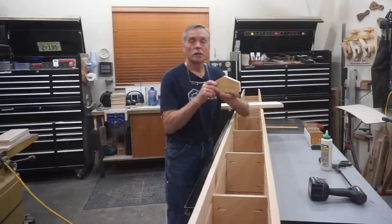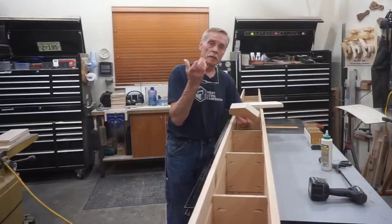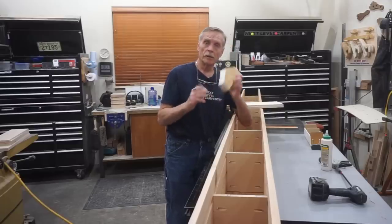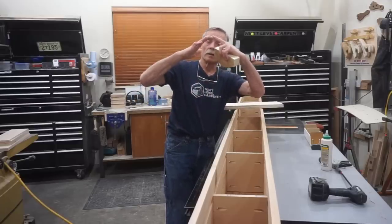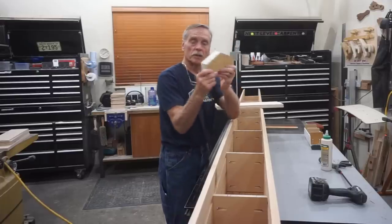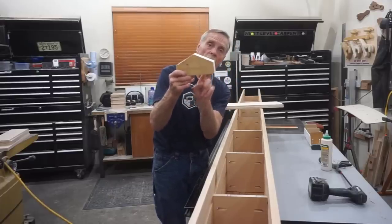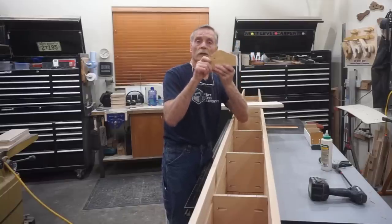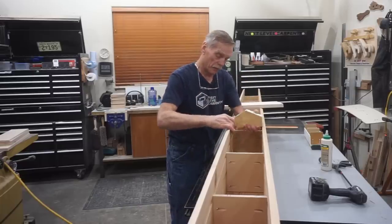And that allows me to make blocks or strips that are attached to the ceiling that in turn hold the beam to the ceiling. In this case, this is going into a cathedral ceiling with a 6/12 pitch, so I've made blocks with a 6/12 pitch cut into them, and I can just screw through the bottom of the blocks up into the roof trusses with lag screws with enough strength to hold that in position forever and always.